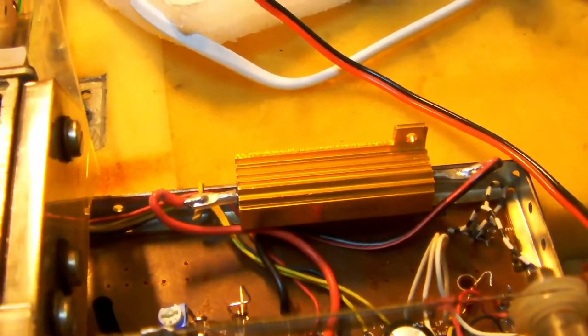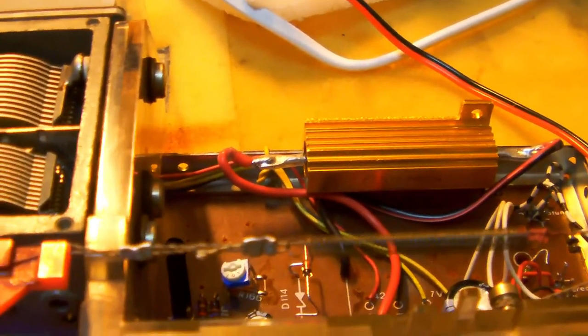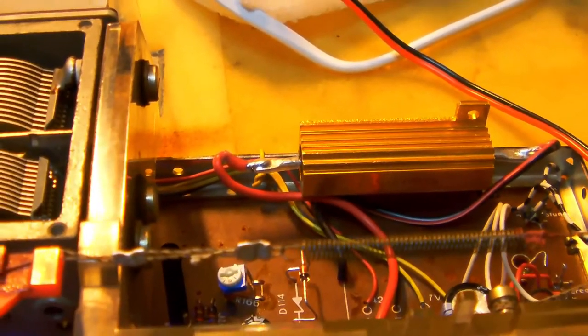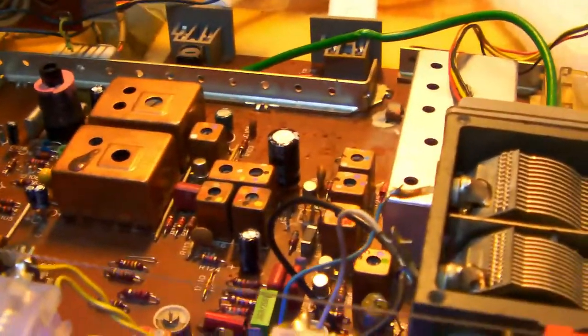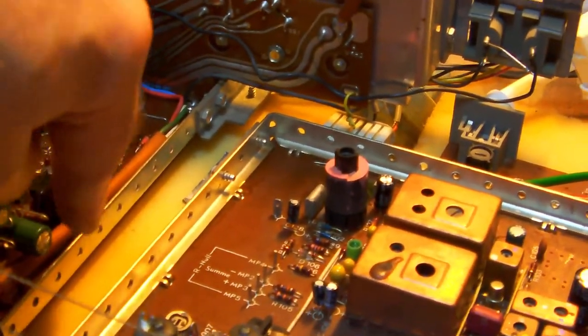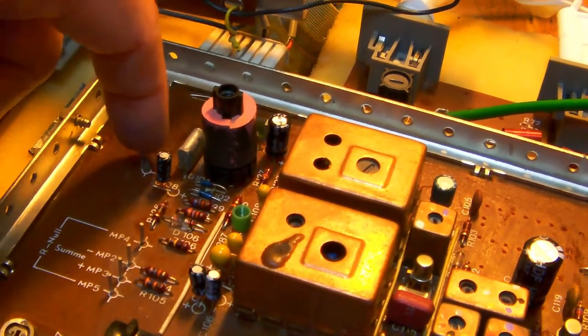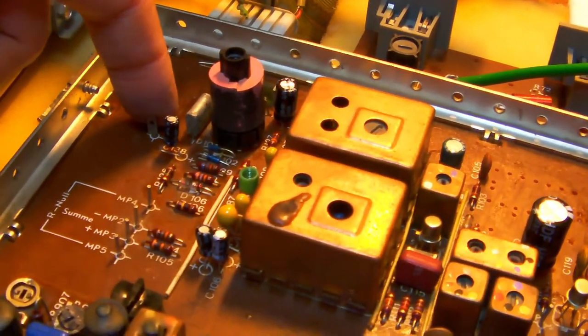There's one last detail that I should make you aware of if you're going to work on this type of tuner. That is that if you're going to measure positive voltages, especially around certain transistors, then you should connect your multimeter to the chassis ground. And the chassis ground is either this edge all around the PCB, okay? So all around it, all of this is connected to ground, or you use the designated ground pin, which is here, okay? So this pin here is a ground pin, all right? So that's for positive voltages.